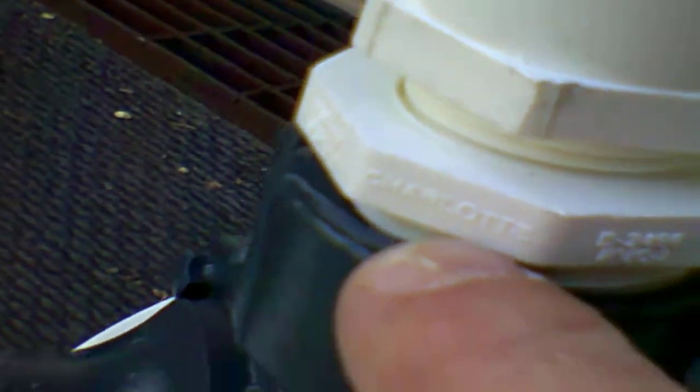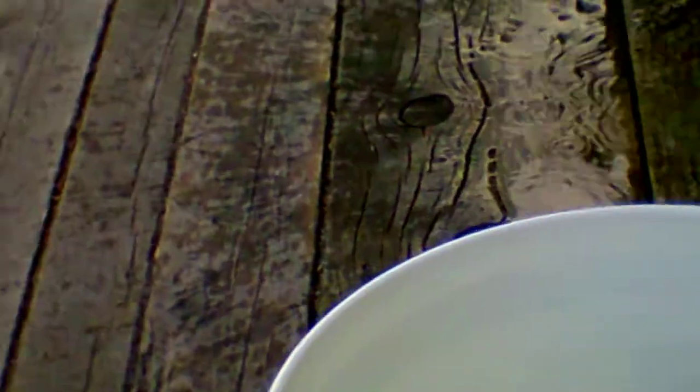And let's see what this does. This is supposed to pick up like 25 feet, so we'll see if it even works at all. It could be I'm getting air through my pipes — none of these are glued. There we go. That's what it was, it just needs a little bit more water. Now you can see how fast that's pulling. And you can see water leaking here. Like I said, I don't have any pipe tape or anything on here, I don't have them really super tight. I will be putting pipe tape on there and gluing all my pipes together when we use this. And look at that go.